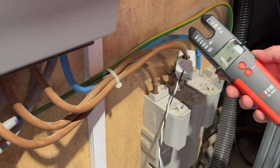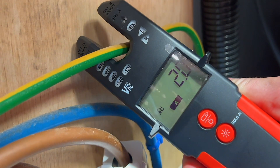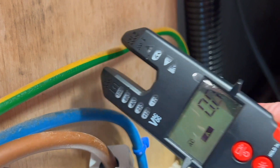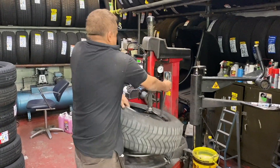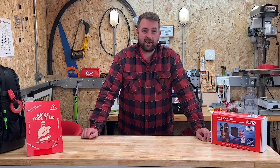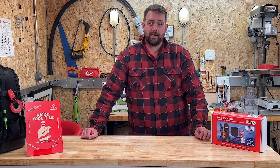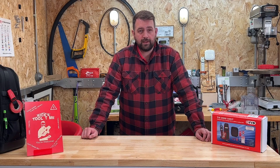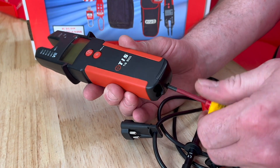The open jaw clamp meter can be used to measure AC current flowing in the live conductor as well as the protective conductor. In our installation we have a current in the earthing conductor which increases when our tame tyre fitter next door has its compressor running — further investigation required. This feature is a fantastic way to start the investigation into diverted neutral currents or possible signs of a broken PEN conductor. Having this built into a voltage indicator is a great feature.